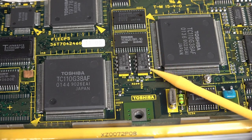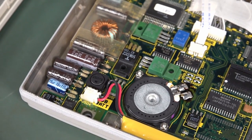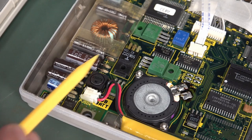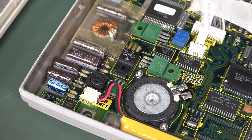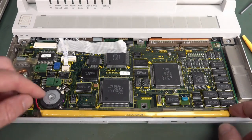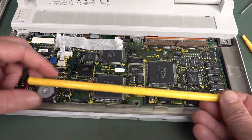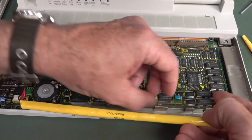There are two 10-pin DIP parts - what the heck are they? We have a power supply over here - it does have an intelligent power supply in quote marks. I like the fact those caps are Nippon Chemicons. As a matter of course, since this is a switching supply, I'd be pulling all those out. What's interesting is this long battery here says 'sub-battery.' What's a sub-battery? It looks like they've got five N-cells all in series. Does that keep it in RAM when you do a soft power-off?